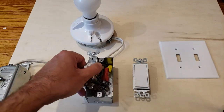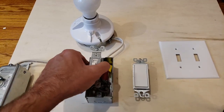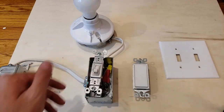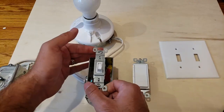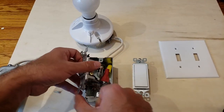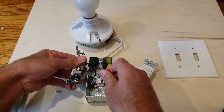If you're unsure about the wiring, it's a good time to take a picture of what your existing wiring is — it will help you make sure that you get the wiring right when you put the new switch on. So we've got these two screws removed. You can then pull the light switch forward and out. I'm going to rotate it to show you the wiring so you can see what's going on and how it is wired up.